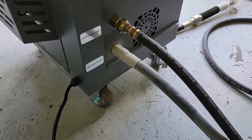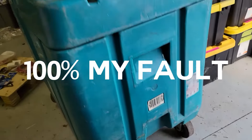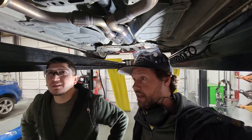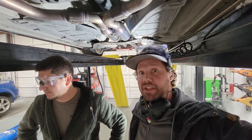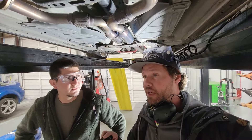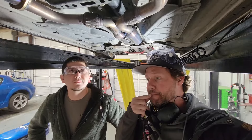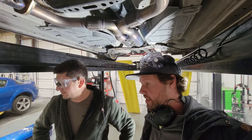After seeing this thing fail miserably, I realized 100% that I did not have the CFMs nor the PSI to actually make the machine work, which was super disappointing. I had to pack everything up and head over to my buddy Shay's shop to get some work done. After many trials and tribulations, buying a new compressor and hooking up all the new lines, we still didn't have the CFM needed — because we reduced it down to quarter-inch line, it didn't work. So I came over to Shay's shop, Ten Tents, and used their manly three-compressor air system, which did everything this thing needed.